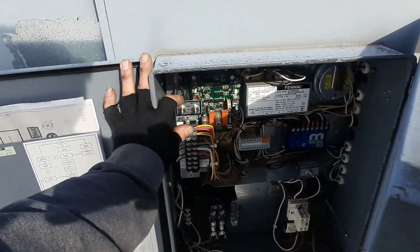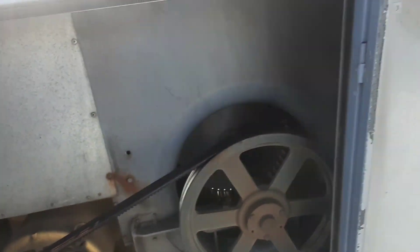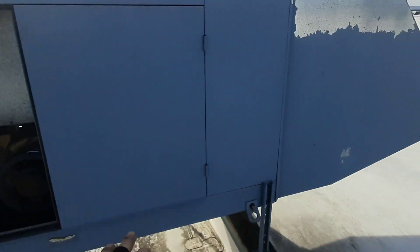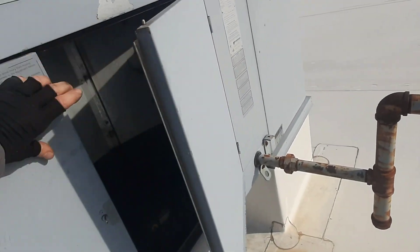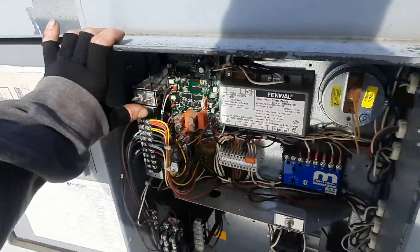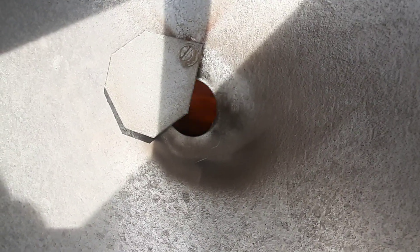It's not wobbling anymore. Let's close this back up, and now that the damper's open, let's see if the burner will fire first, and then we can get into the actuator problem. What happens if that damper stays open is if it shuts off to satisfy space demand, you'll get cold air migrate down and it'll actually drop down into the space. Let's give it a shot — let's see if it won't fire. It's got airflow now so it's gonna keep running.